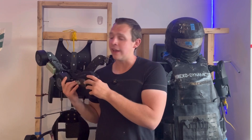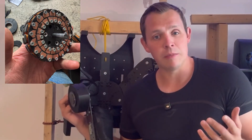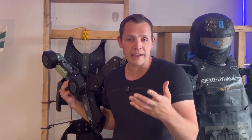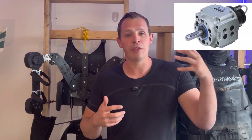This ability to use different types of propulsion is something I've tried to include in my power armor design, namely with the actuators on the exoskeleton. These are actuators of my own design - currently mock-ups - working on a design I can produce myself in the United Kingdom. These are quite big actuators, which makes it much easier to make because there are fewer small tolerance parts. It also means they can be replaced with different types of actuators quite easily, because there aren't as many size restrictions. So while these are going to be electronic actuators, in the future there could be versions with hydraulic or pneumatic actuators fitted, and there's plenty of space to do that.